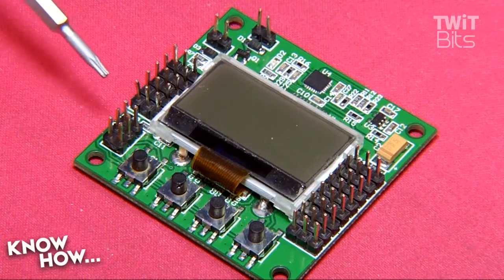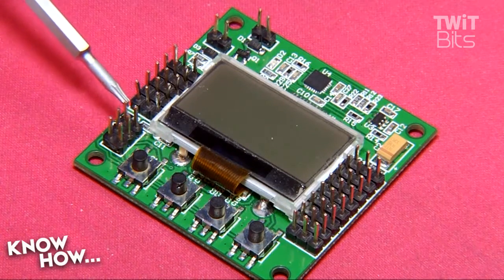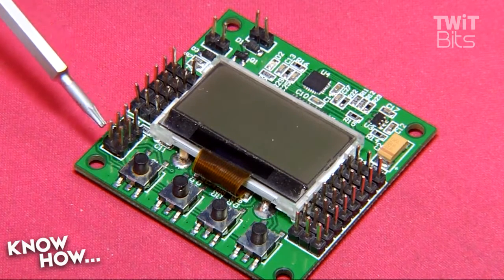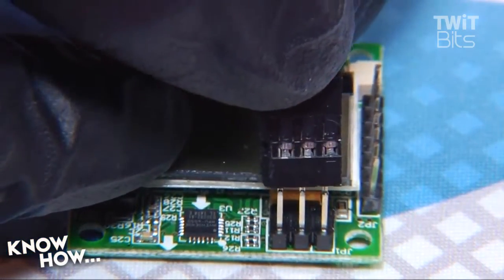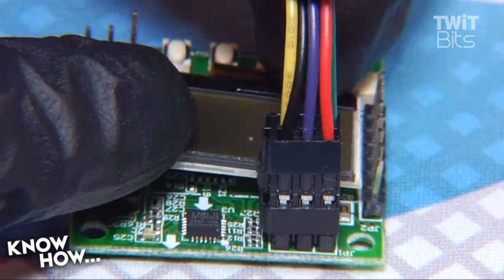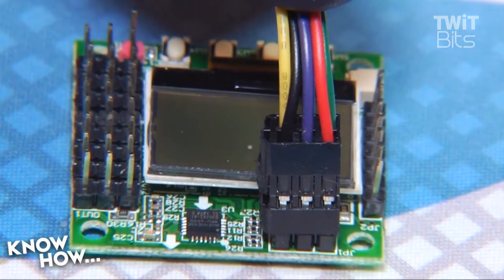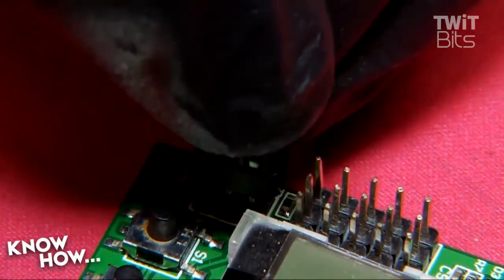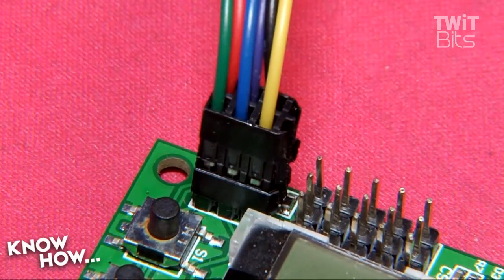You'll need to remove them if you want to fit it on your full-size KK board. Connect the AVR programmer to the six programming pins on the KK. On the full-size model, the pins are at the bottom of the board to the left of the buttons. On the Mini KK, the pins are above the board to the left. Plug in your programmer with the yellow or orange cable towards the center of the board. If your AVR programmer doesn't have a yellow or orange cable, then plug it in with the cut side of the connector towards the center of the board.